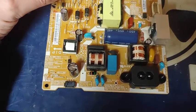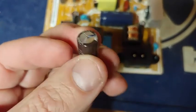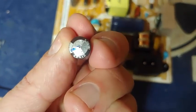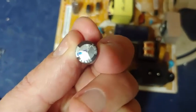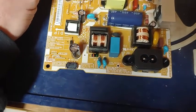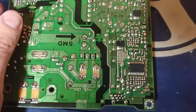This capacitor here looked to be the culprit — see, the top of that capacitor is bulged. In the very center there's a blue streak. The telltale sign that it's bad is not only that it's bulged, but there's a black dot in the middle, because it's a little bit cracked and it's starting to leak. That's the telltale sign that this capacitor is bad.